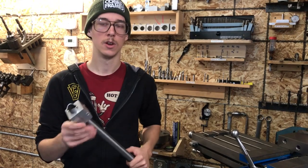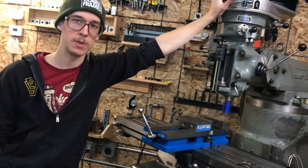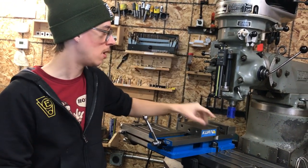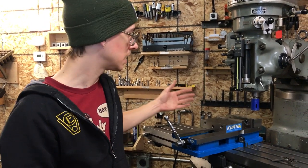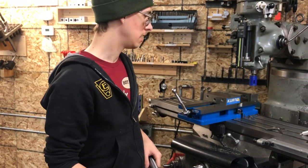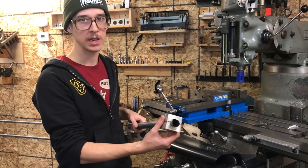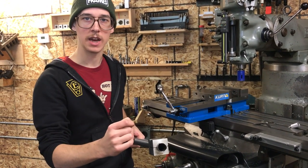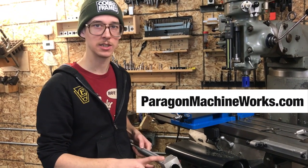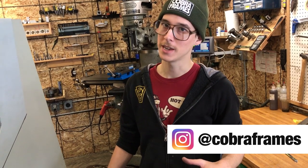Certainly for someone getting started on the cheap, really valuable. Before I had this milling machine, I had a $350 mini milling machine — basically what you can buy from Harbor Freight, bought used. It takes the same R8 collets as a Bridgeport, much less rigid, much lower horsepower — not really a real milling machine. But I was able to make pretty decent miters on it; I used it to miter the main tubes for five or ten bikes with the same setup. With this same method I was able to get pretty good results, deburr the ends, and they would fit pretty nicely with less than a fingernail's gap — making a nice clean weld or brazed joint. I'm definitely a big fan of this and I suggest you all give it a try. Thanks for hanging out and watching the video. Subscribe to the channel, follow me on Instagram, and make sure you thank Clementine Puppy Paws for her valuable contributions.